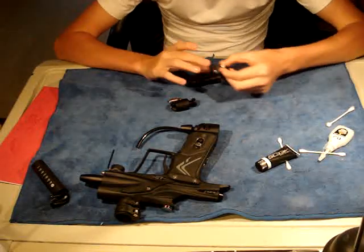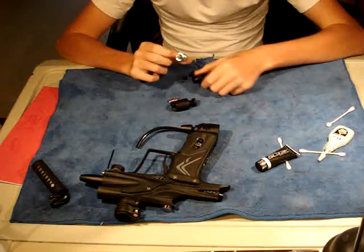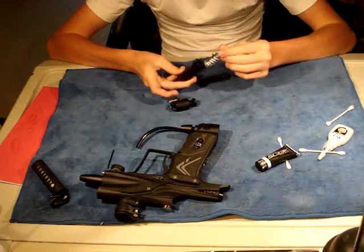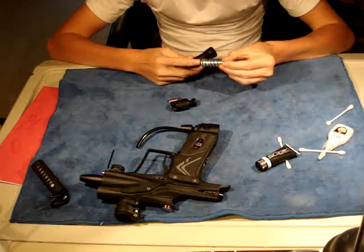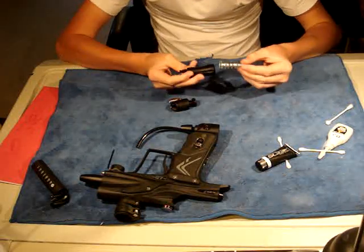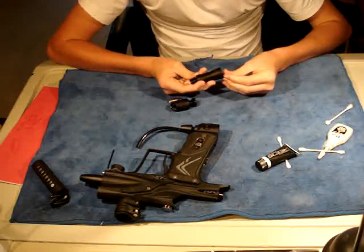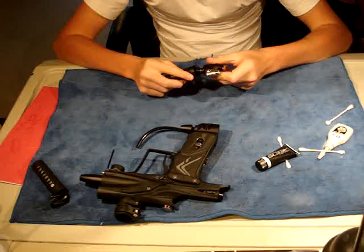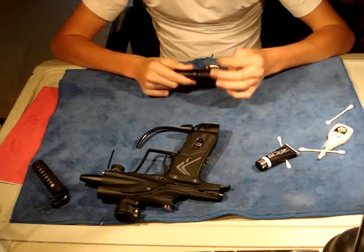To put it back together, just slide your spring on — it's a non-directional spring, so you don't have to worry about putting it in upside down. Take the piston; the part with the O-ring goes on the male part of the regulator. Then take your bottom part and screw it in.